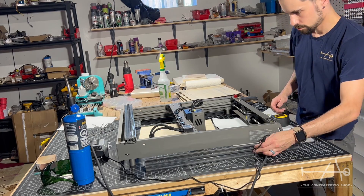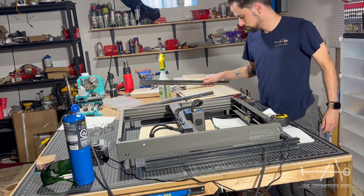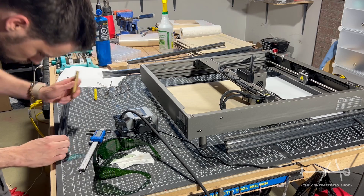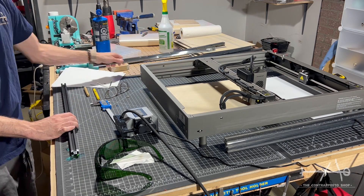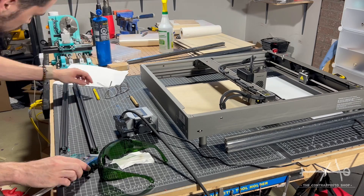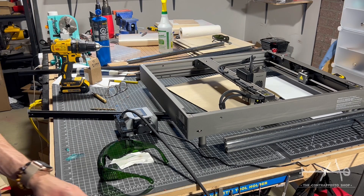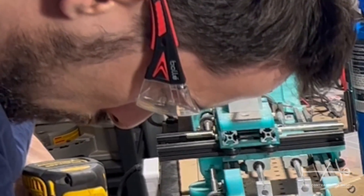This build was on a budget, so the simplest solution is to go with aluminum extrusion. Here you see me trying to figure out the layout of the enclosure. I already had an idea on how to build it, but obviously I ordered the wrong length. I ordered a pack of 10 extrusions of 600mm — I would suggest at least 650mm because we had a little problem you will see later. Aluminum extrusions are cheap, easily available, and sturdy. Like Legos, you can build something great without too much effort. For the frame we just needed to drill holes at the extremities to make blind joints, using button head screws that slide inside the bars and thread into the other — no special brackets needed.